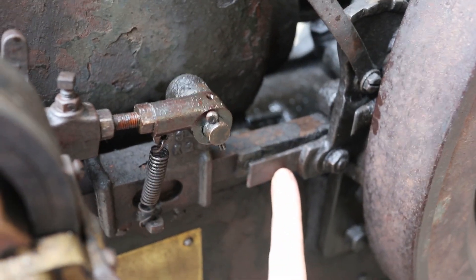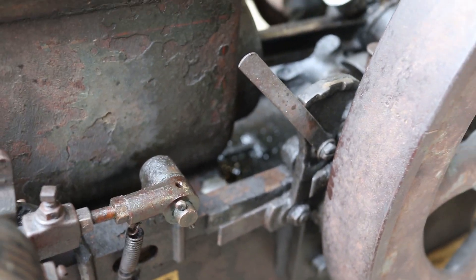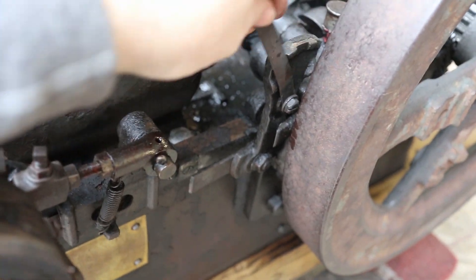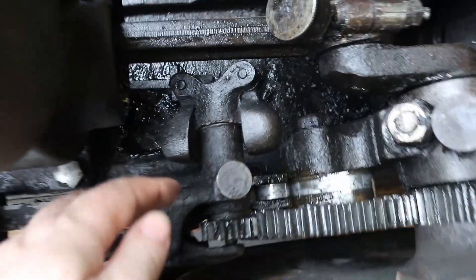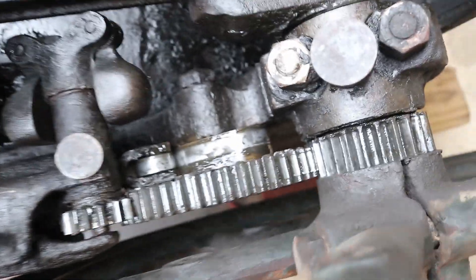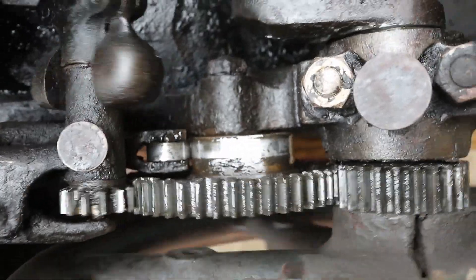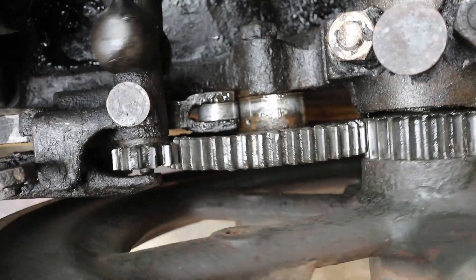Here's a better view of that latch-out bar that hooks on the push rod here. There's a little lever on the side — this lever is kind of like a spring-loaded tension for that latch-out bar, and that's actually how you control the speed, the RPM. And here's those governor weights right here. Those governor weights push that little pin behind the gear there. And there's that cam lobe with the follower — that's pushing for an exhaust stroke.